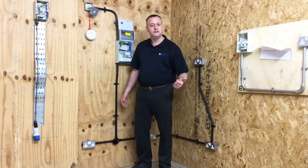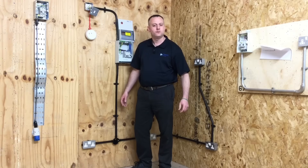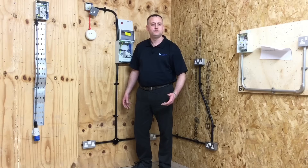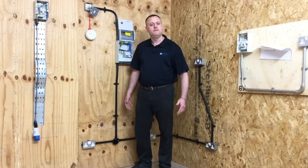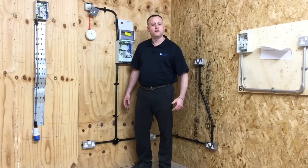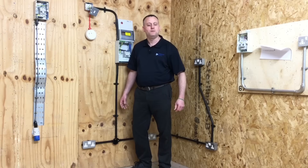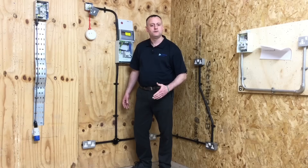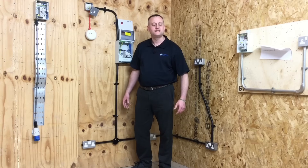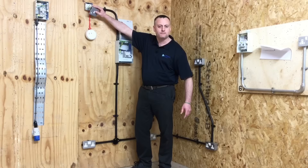For recap: PVC stands for polyvinyl chloride, comes in a standard 3-metre length, in four standard sizes by diameter — 16, 20, 25, and 32 mm. We use high impact heavy gauge conduit, and it must be installed at a temperature above zero. If left outside overnight below zero, it would need 24 hours at ambient temperature above zero before installation. Our ring final circuit has additional sockets taken from it as fused or non-fused spurs. Non-fused spurs from a ring final circuit are limited to the number of socket outlets on the ring — one spur per socket. Where fuse connection units are installed, the maximum fuse size is 13 amps, and from that point you can have as many socket outlets as you wish.